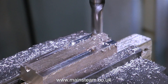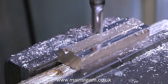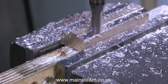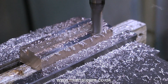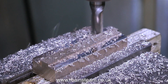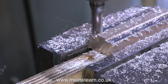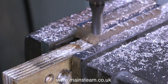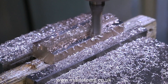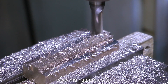Normally for a twin launch engine, Stuart Models supply some castings for these parts, but I need to modify them slightly. When using the castings, the idea is that you drill all the way through on two of them and only part of the way through on the other two — this is the way it's shown on the Stuart drawing for the twin launch. But I want to modify this design slightly: I would like another inlet and another outlet on each side, so that the engine could be mounted in any kind of installation without removing the pipes to turn them round.